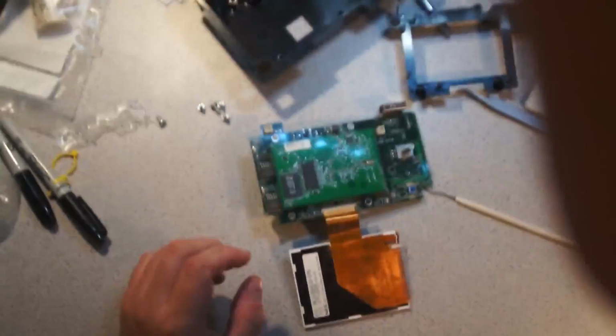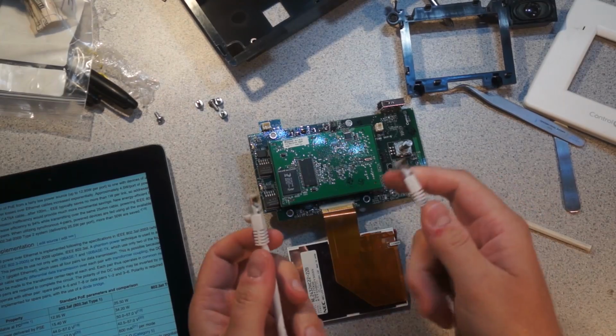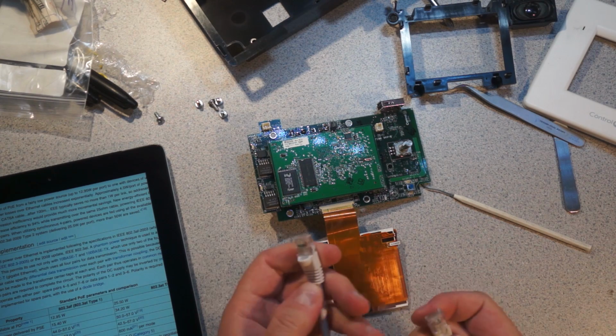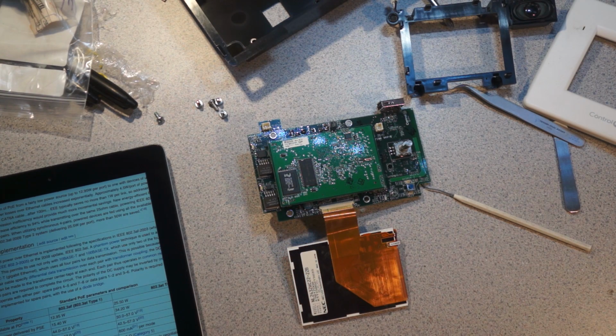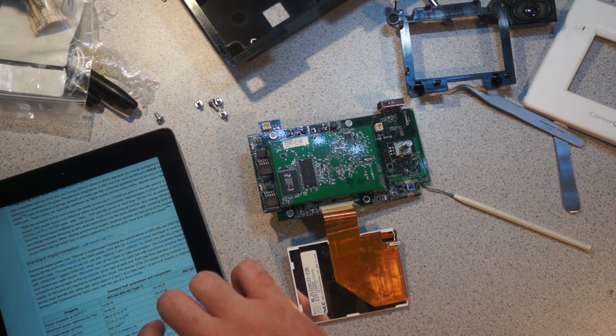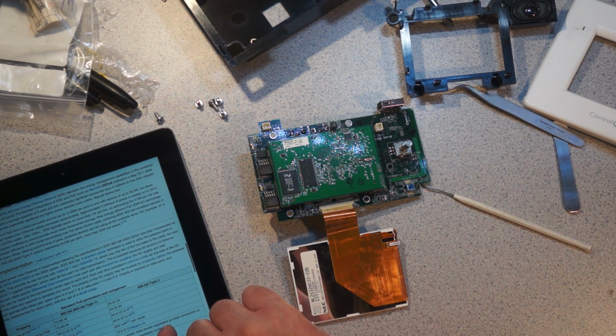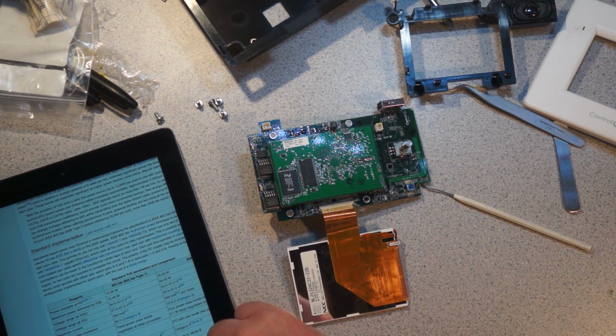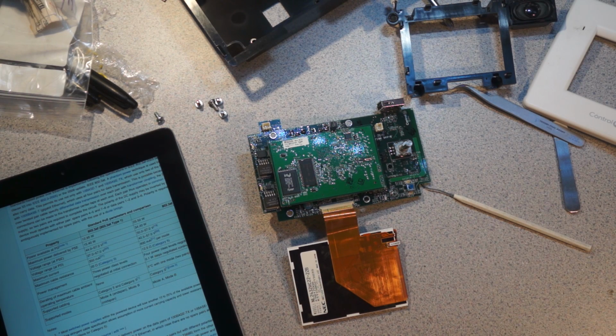So now I need to go try and look up PoE and remember how it works. So here's a network cable where the clip at one end broke off. You know, it catches on something when you're pulling the cables out of equipment or whatever. So this is kind of going to be my sacrificial goat. According to the Wikipedia of wikis, considering also that it has 2 bridge rectifiers, I think you just stick power on any of the pairs. I'll certainly try that. It's not like I care that much. So the pairs are driven common mode, but it doesn't really matter which one.